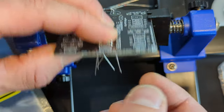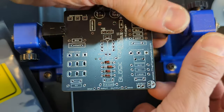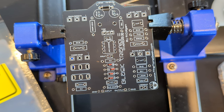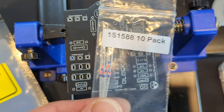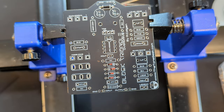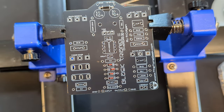You can substitute these — they're standard diodes. The 4148s, otherwise known as the 914s, can be swapped out with new old stock 1S1588s. These are new old stock Toshibas that went into the tube screamers back in the day. They have basically the same forward voltage characteristics as the 914s and are often substituted in and out. And when you're done with the bags, feel free to save them — I reuse them to reduce waste.